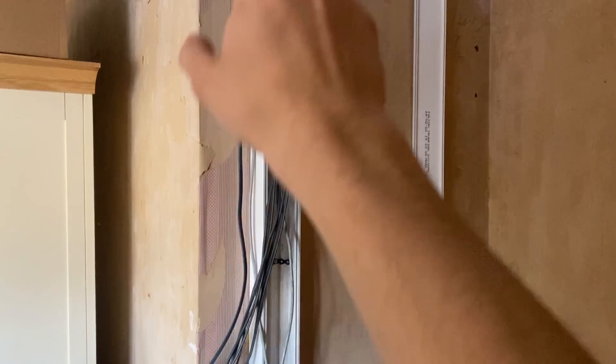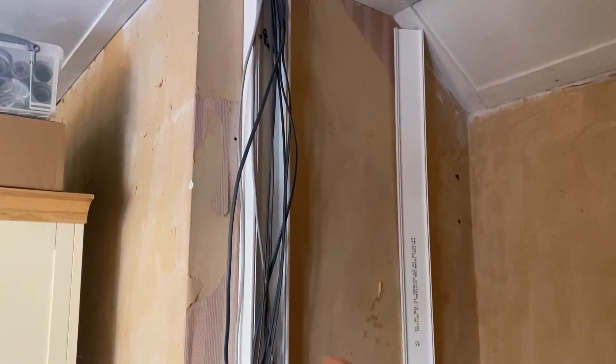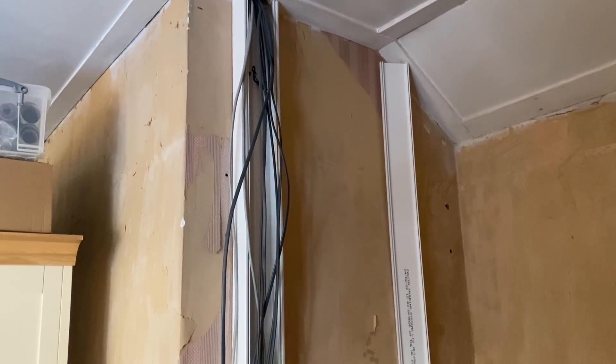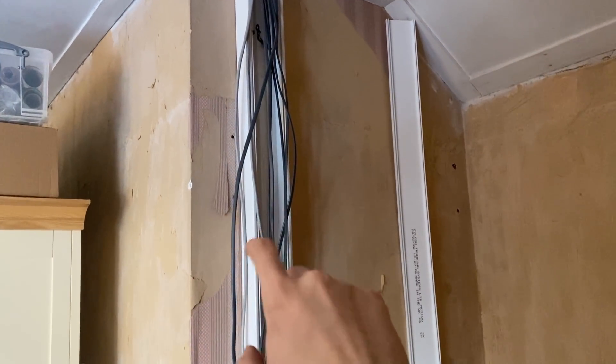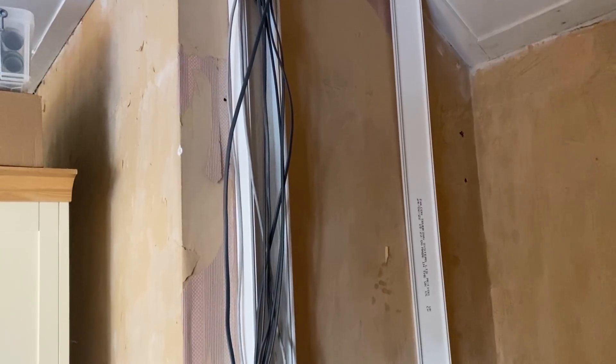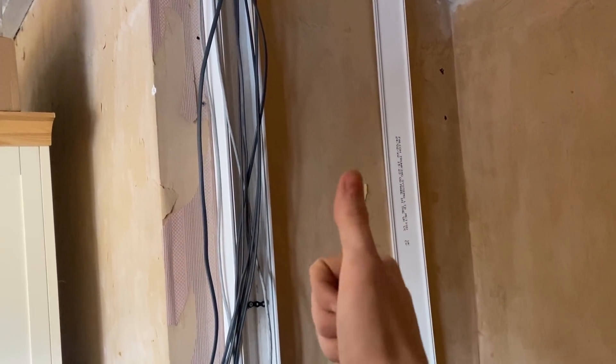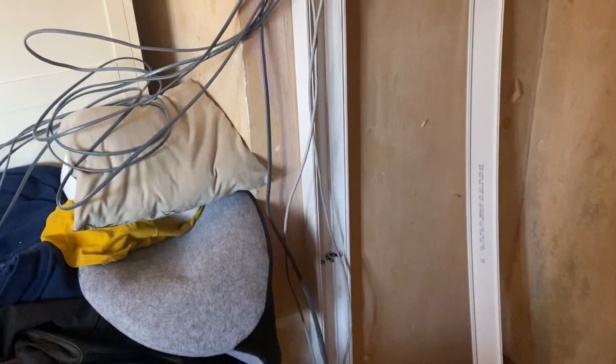This video is going to cover me dressing all these cables neat and tidy. You've got the different bands - I think that's correct - so I'm going to be putting ethernet on one side and power cables like the lighting and socket power on the other side. Just a bit of separation really, so you get a better connection.